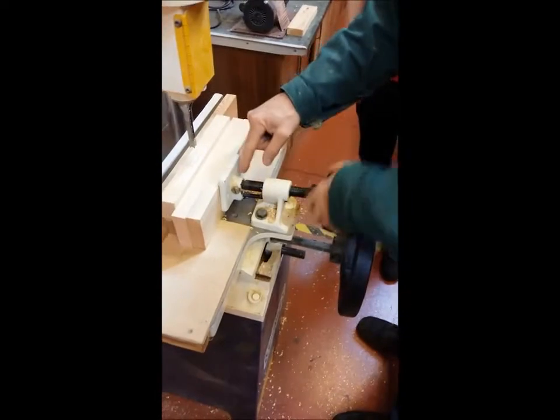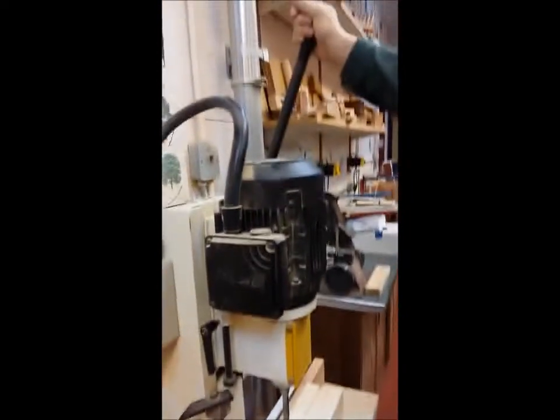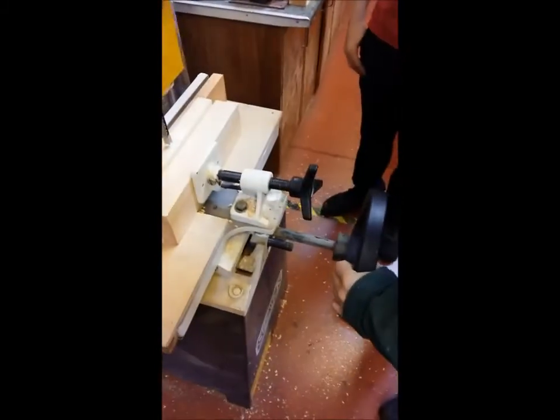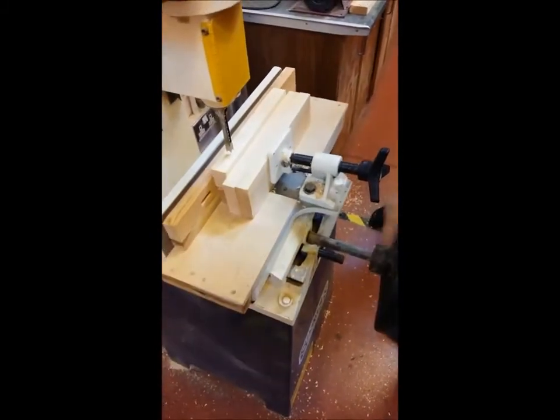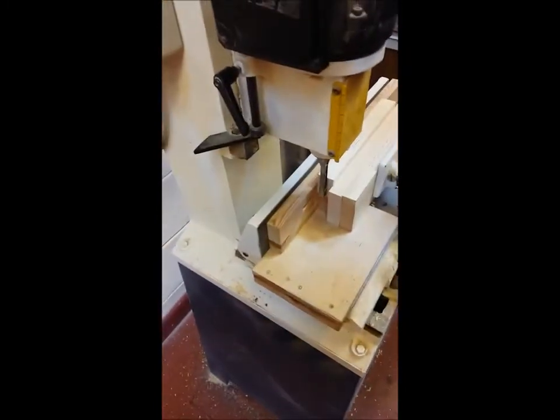When we're lining up the piece we want to mortise, we put it in line with the vise grip against the faceplate and tighten it up. You can see the wheel here has been adjusted left and right, and I can move it in and out. I'm taking it out to the end and adjusting the stop on the left-hand side to make sure it goes through the whole piece.